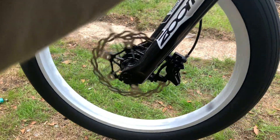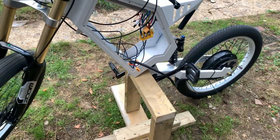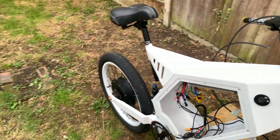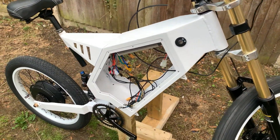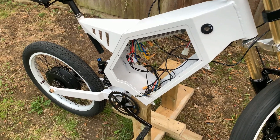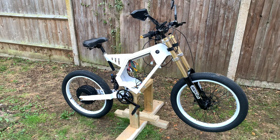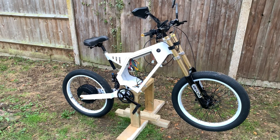I haven't got any hydraulic pressure in the caliper yet, but it spins freely and everything's looking great so far. It's mainly a dry fit — I've had a short ride on it and it was good. I'm going to strip it back down and get all the correct bolts. I do need to get some bolts for the rear shock, as right now I've just got an M6 nut and bolt — I want some hardened steel hardware.